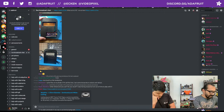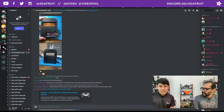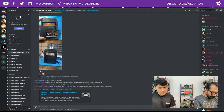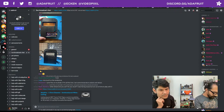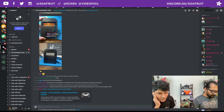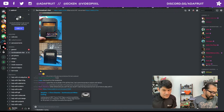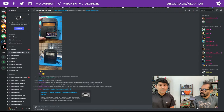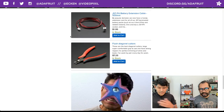So your mileage may vary, but it did work, as I said earlier, with having the 85A on a Bowden extruder. Okay. And since the Enders are a little bit close to the CR10s in terms of the way that the extruder is, it should work on an Ender as well. So definitely let us know your results on that. It worked pretty good on ours. Sweet. DeWester is saying that they're printing Flex on their Ender 3 Pro all the time, just some temperature adjustments and retract. That's great. Yeah, we're using 230C, or if that doesn't work, you can go up to like 235 or 240. Okay. And we'll get to it. Yeah, 50 millimeters. We'll have some reference points.